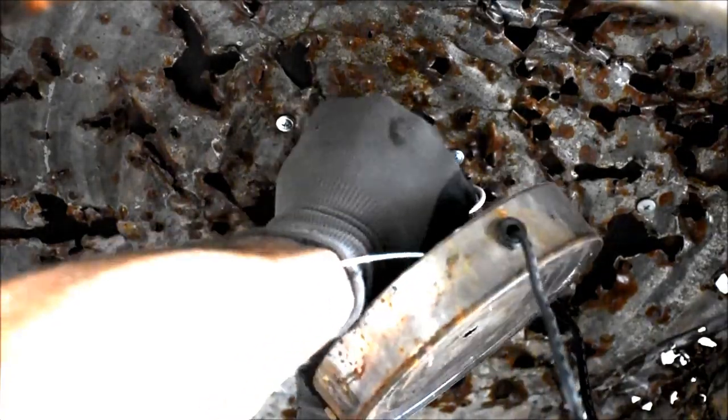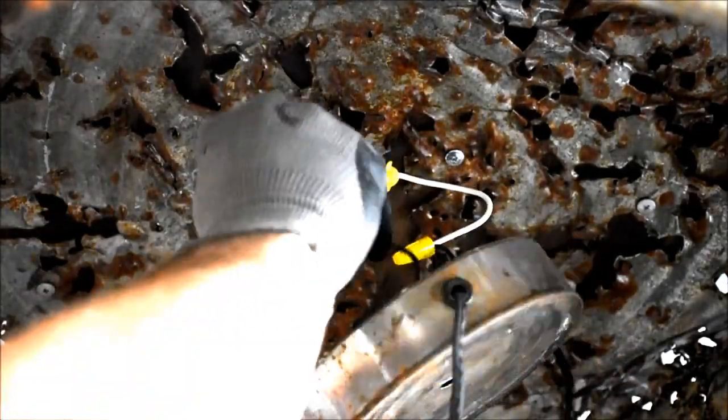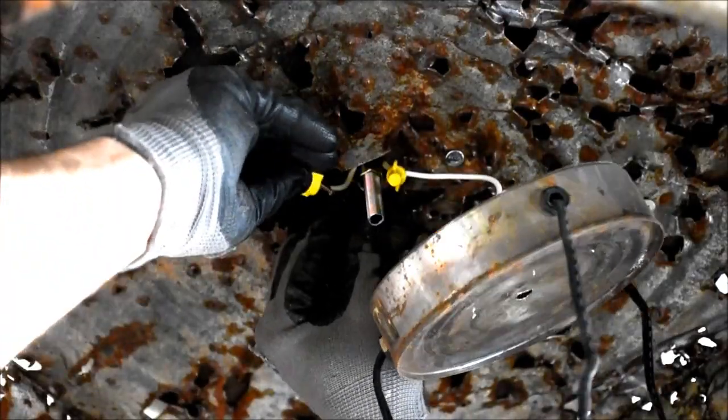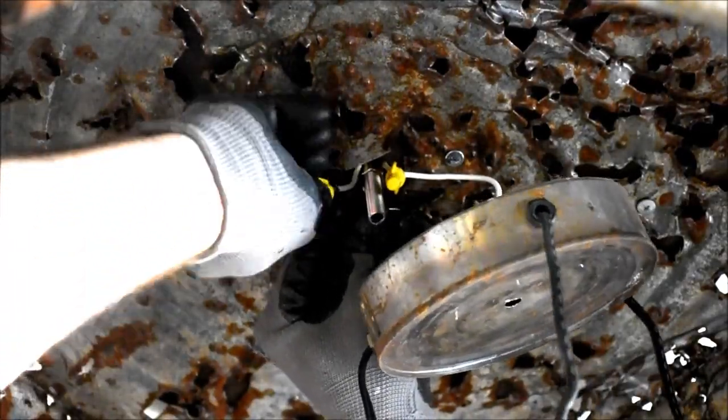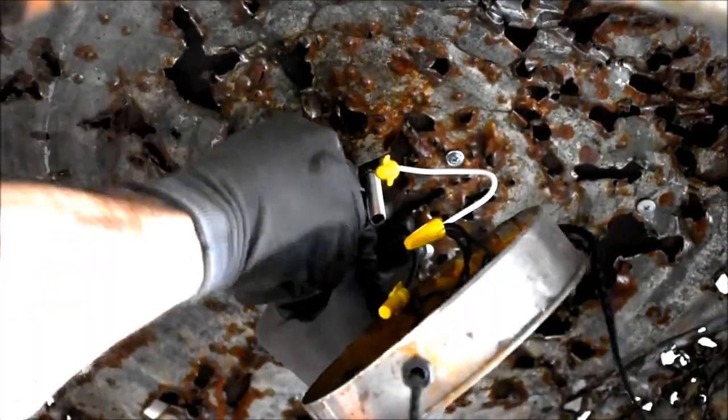All that's left now is to connect the wires coming from the fixture to the wires coming out of the ceiling, white to white and black to black. I know right here that wire looks like it's white that's coming out of the ceiling, but that's just white paint on the black wire. Everything's good.